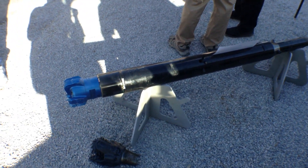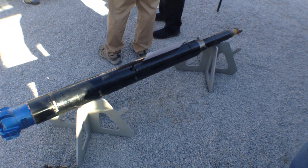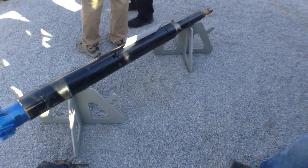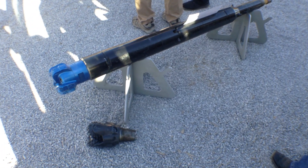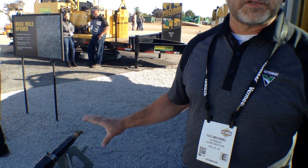As you can see here with a drag-style PDC bit on and a roller cone sitting on the ground beside it — you're capable of doing that, or taking those bits off and putting an air hammer right on the end of it. You can also run standard dirt tubing on this machine. You can take the drill rod head off and run standard dirt tubing.